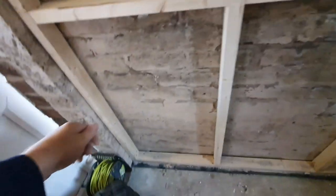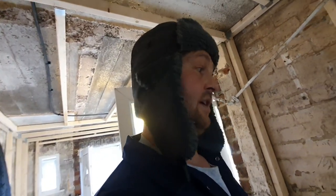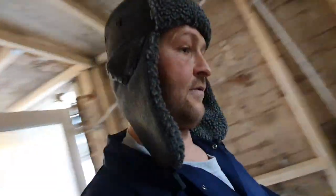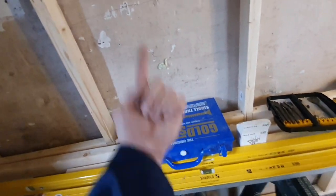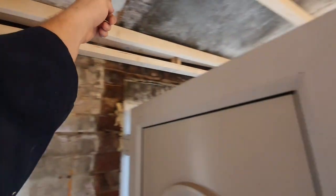Actually, I could send it straight round like that and come up everywhere. It may save me quite a lot of cable to do it that way. I'll come all the way round the bottom and come up, because this is coming up from behind the worktops, rather than run it across the ceiling. When I get back to this point where I've got my last socket for the washer, I'll bring the cable back up through here, across through there — just across this ceiling here. You've got your ring and that is a ring main, so you'll loop it all the way around, pick up all of your sockets and then go back.